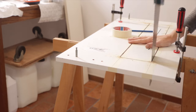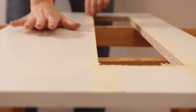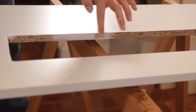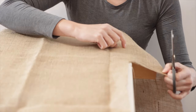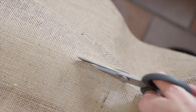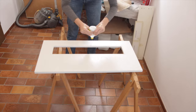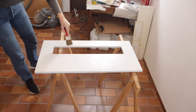And I was so excited to remove the middle piece and to see that my cuts were so clean. You can see the difference between the old wood of the mom that was obviously used and the new wood. And then I went ahead and still used my wood putty all around to clean it up. Next, I had to put a linen cloth, and you can see again that it was super easy to see where the line was and to cut it straight. I went ahead and put extra glue, especially around the window, because I really wanted to make sure that this was very well adhered so that I wouldn't have any issues, even if Kitty decided to scratch on it.